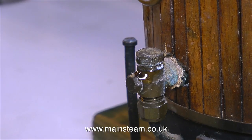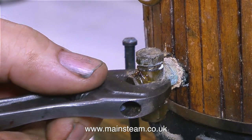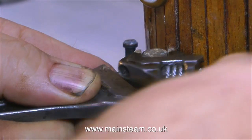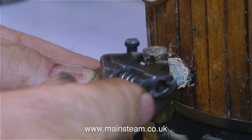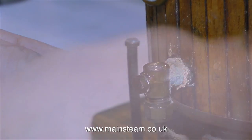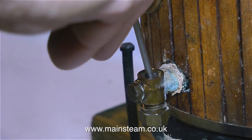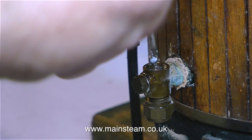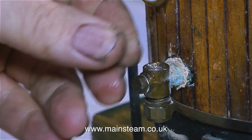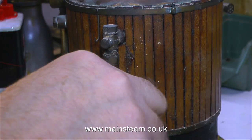In this clip I'm taking a look at the clack valve - the valve that allows water into the boiler but doesn't allow water out. It's a one-way valve, also known as a check valve. This one looks pretty corroded, and with a little help from some penetrating oil I'm removing the top cap to have a look inside. The good news is it doesn't look too bad inside, but the stainless steel ball was firmly stuck to the seat - and now it's stuck to my screwdriver because the tip is magnetic. You will notice that the entire fitting is full of limescale.